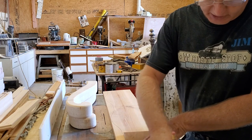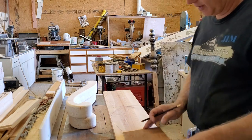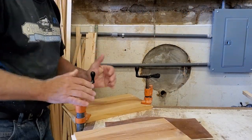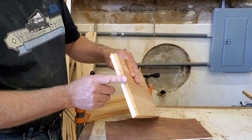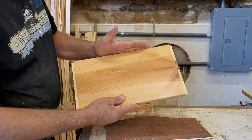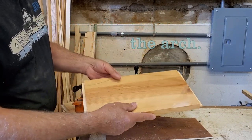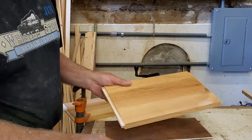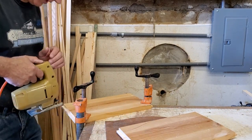You can see the benefit of the pattern here — I don't have to reinvent my curve every time; all three are the same. I've got my pieces clamped up to cut with my jigsaw. I went ahead and did my tenons on these first because it's way easier to cut them when I have a flat face to put up against the fence. You don't want the piece walking around on you. Pre-cutting the tenons is a good tip. I'm going to take my jigsaw, cut these out, and move on to the next phase.